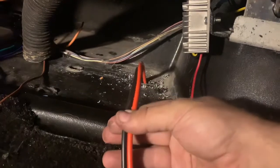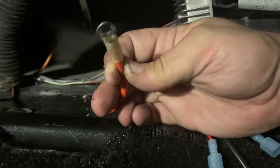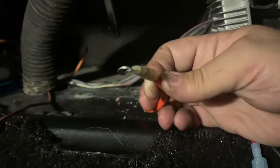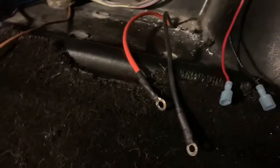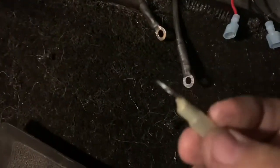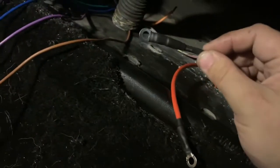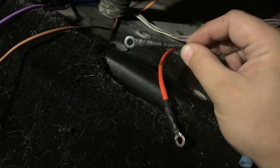So I'm going to cut these wires. When I crimped it, I didn't crimp it right and I'm going to have to flatten that out, otherwise it's a big problem. I don't really do well crimping with the heat shrink stuff — usually when I start heating it up it'll actually split. So I went ahead and put some regular heat shrink over top of the heat shrink.